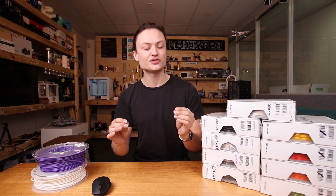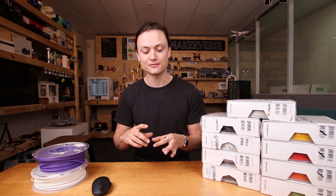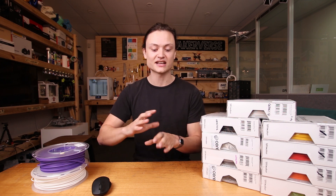Polypropylene is an immensely popular material worldwide with engineers and manufacturers. It's great for producing lightweight parts with a high strength-to-weight ratio and smooth surface finishes. PP has exceptional fatigue resistance, making it good for prototyping bearings and things with high rub. It also has good temperature, chemical and electrical resistance, whilst also being recyclable, which is very important. It is hygroscopic as well, so you've got to keep it enclosed.